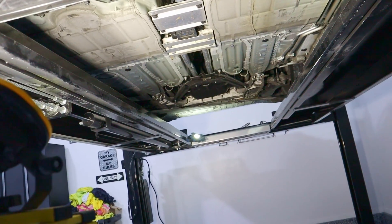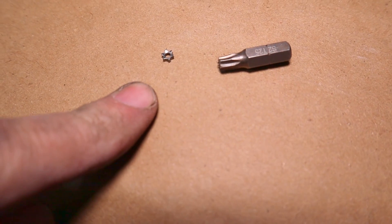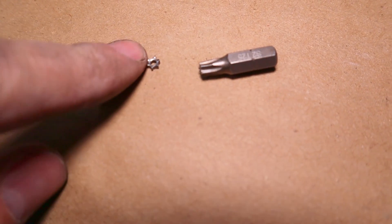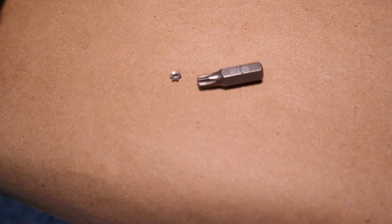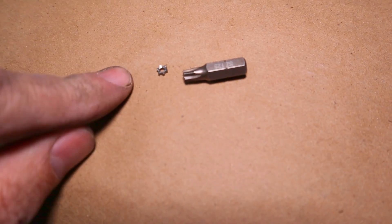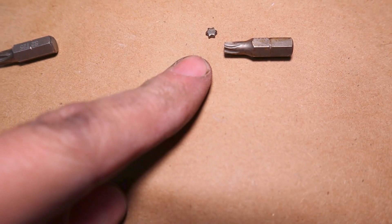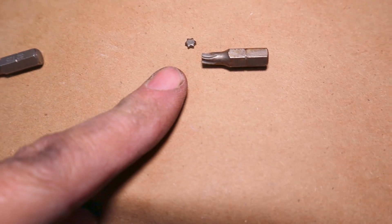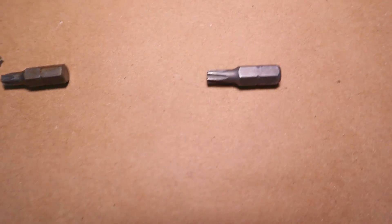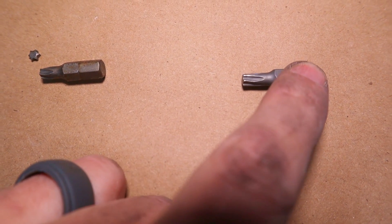So close — I've got one bolt left and it does not want to come out. This was my security bit and it snapped off while I was using the impact driver. I thought that the hole in the middle is going to weaken it, so I went with a solid one — it did the same thing. So no more impact; I'll just use a regular driver. That one's starting to twist as well, so we'll have to get out some extraction tools.